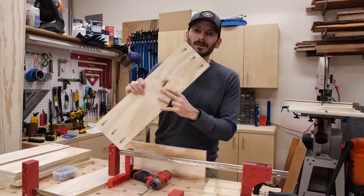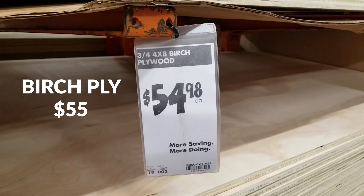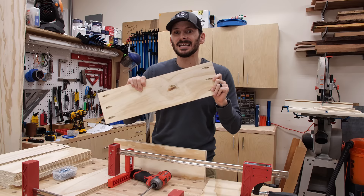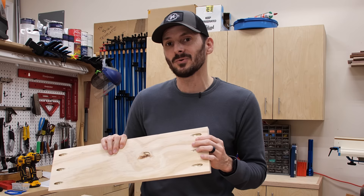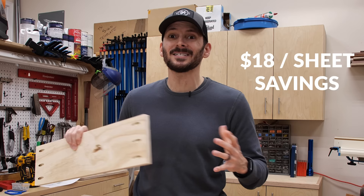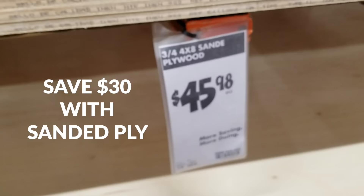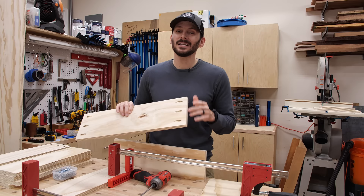The drawers go together with pocket screws which hold well into the three-quarter inch plywood. This is three-quarter inch Radiata Pine. At Home Depot there are different types of plywood — ranging up to about $55 a sheet — but this one was close to $27 or $29. You can get away with the cheaper stuff because I'm going to be painting this. For this project I need three sheets of three-quarter inch plywood, and saving $20 a sheet saves me $60 overall. If you're going to be staining it, go up higher on that scale. Look for sheets that don't have a lot of warp, and you can invest that savings in drawer slides or other hardware.